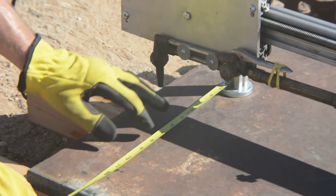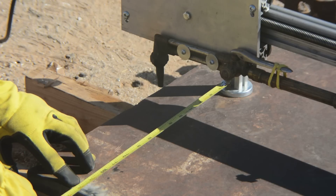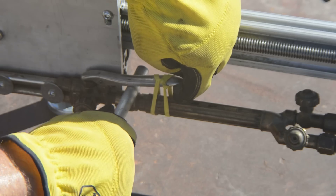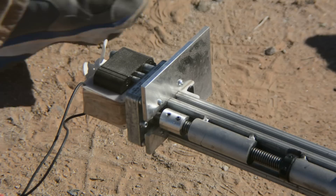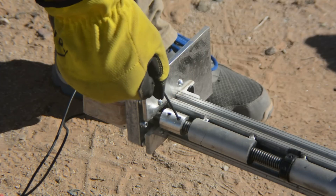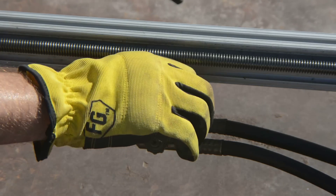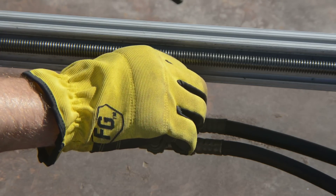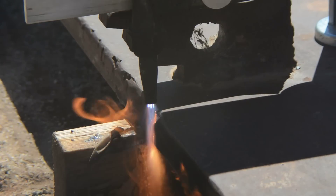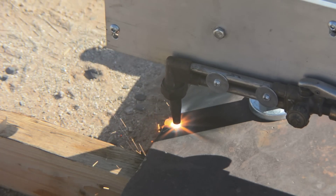Let's make some cuts. Set the track up by measuring the feet — set the feet at the same distance from the edge for straight cuts; setting the feet at different lengths will give you an angled cut. A pull rod holds the handle open while a rubber band is used to activate the oxygen. Tighten the set screw, turn on the torch, and set the flame correctly. Let the puddle form under the torch, then pull the rod out from the oxygen handle and turn on the drive motor.